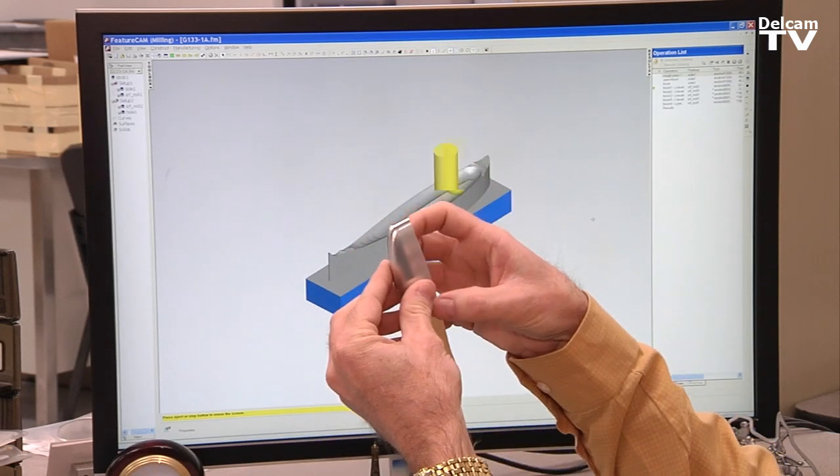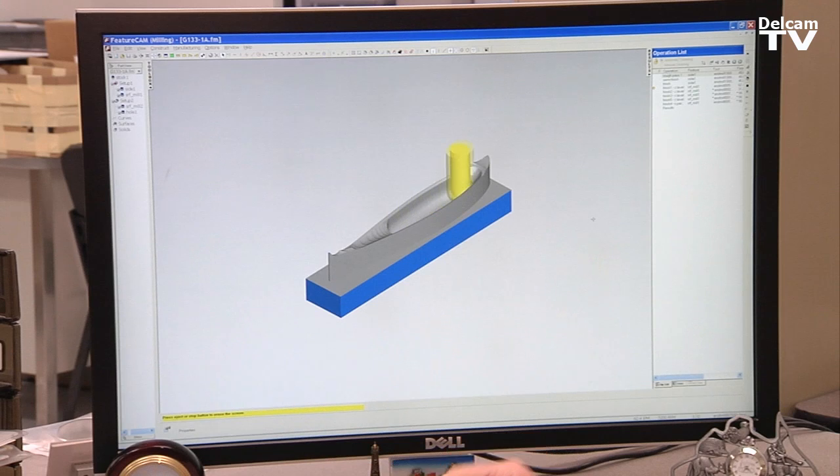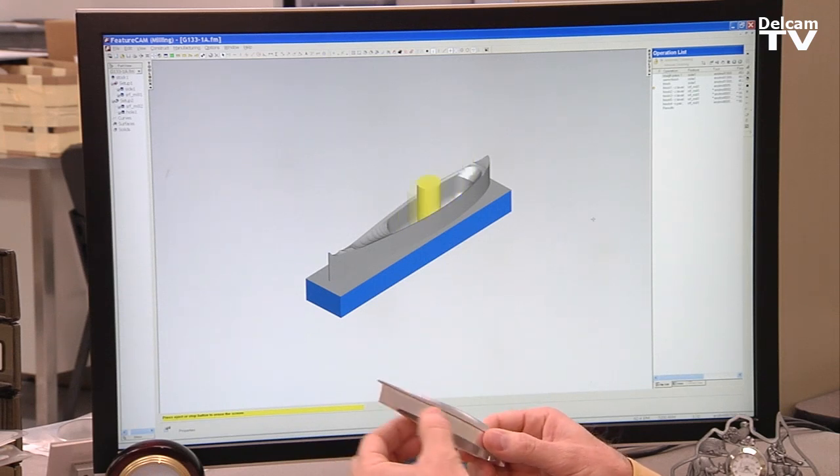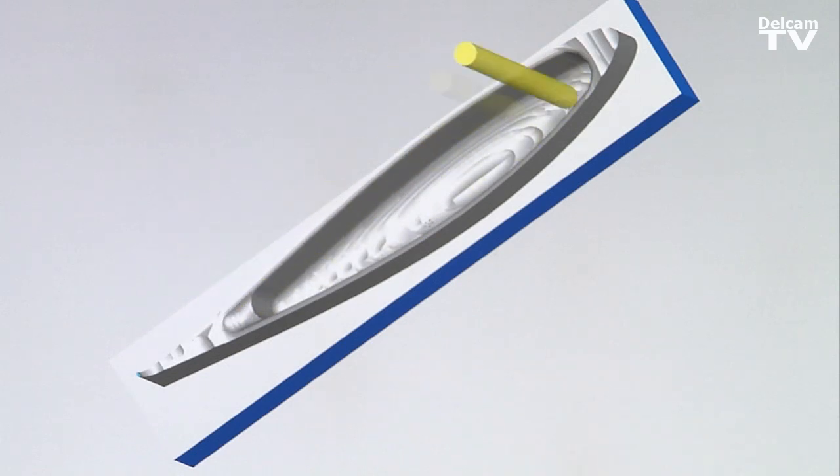You really have no flat surfaces anywhere — it becomes very difficult to cut. We have to progressively get a ball end mill and get smaller and smaller diameters to get out that material, because otherwise the bigger diameters can't fit and the smaller ones would break.